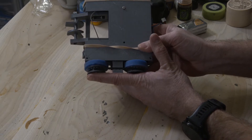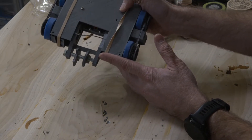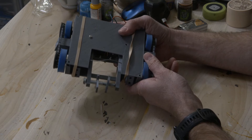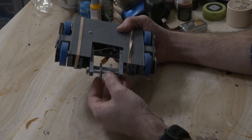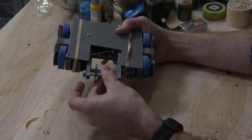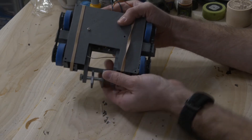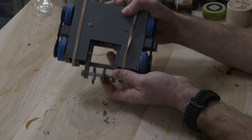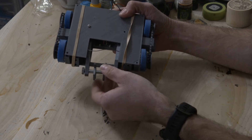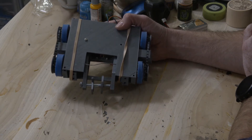In some cases, like with the front mounts, there's no space at all. So basically the armor would be rubbing up against the wheels or the drivetrain. Number two pertains to the weapon mounting system. Right now this little bolt I've got here as my stand-in for the shaft doesn't quite work because it's not secured on both ends. The weapon blades come awfully close to that little piece of the chassis. These blades are going to be UHMW, and UHMW can flex a little bit, and if they flex and hit their own chassis, well, that's a bad thing.